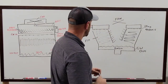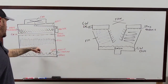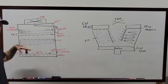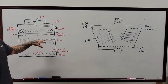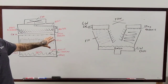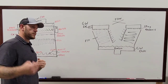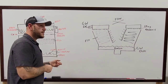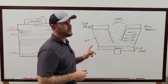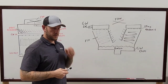Oh, for instance, on the outside of these towers, most of the time to access these, you know, the little square panels that they have there? Mm-hmm. Correct me if I'm wrong, Holden, but those are actually called louvers, if I'm not mistaken. Even though it has that plastic little fill in there, those are called louvers. And all that is just to divert the air in a certain direction into the tower. So it's important to install them in the correct direction. Exactly. I have noticed in the past that somebody had flipped those all around.